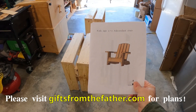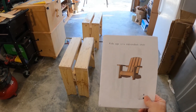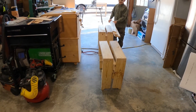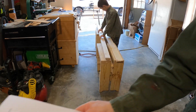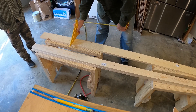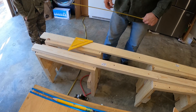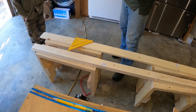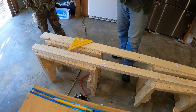Today we're going to be working on the kids Adirondack chair. We're going to make our first one out of pine, and we do have some PVC that we're going to make some out of for outdoor use. Let's go ahead and mark out the rough cuts first — the rough length cuts are on page two of the plans. Measure your rough dimension, leave about a quarter inch for the blade, make a mark, and cut all our rough dimensions first. Then we're going to go back and mark our individual pieces that have curves.